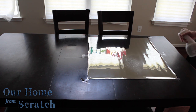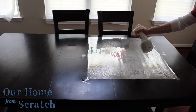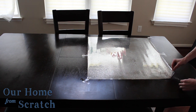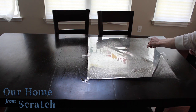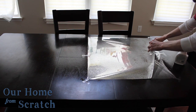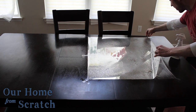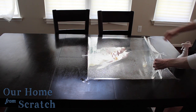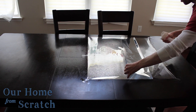Now I start using the Gila product — their liquid sold separately, which comes in a little kit. It's basically water and some kind of soapy stuff. I spray down the whole top of the film and also part of the table. This film is extremely tacky to itself — there's no glue, no adhesive — but if it touches itself it's going to stick and leave a crease, which won't look good on your window. So as I peel it off using the tape tab in the corner, I'm spraying all that exposed edge I'm revealing on the other side. I fold it over on itself and spray the whole thing. If I hadn't sprayed the top and just spray as I pull, it would stick to itself and you'd be done.